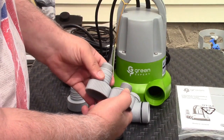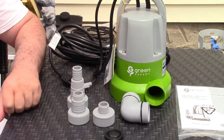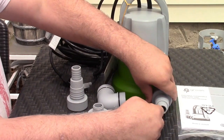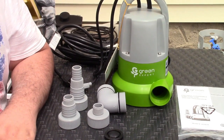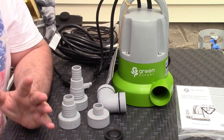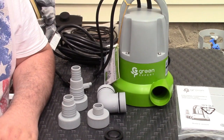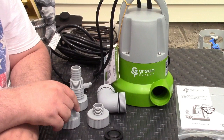Physics applies here — the pump outputs 2,000 gallons per hour with a nice big opening. When you convert that down to a smaller fitting, you're essentially strangling the pipe, just like having hands around your neck. So when you use a garden hose — which is the first thing you think of when your basement floods — it will work without any problem, but you're not getting anywhere near 2,000 gallons per hour. Speed will be completely dependent on whatever size hose you use.